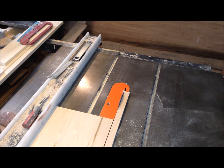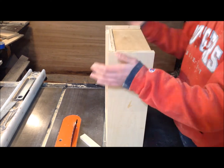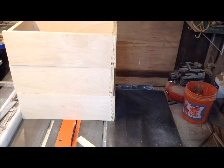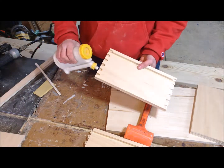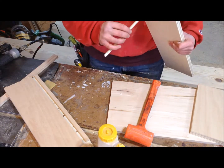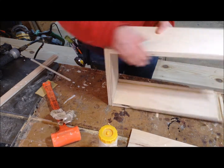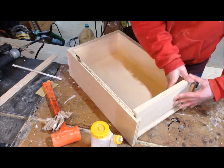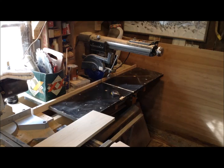Like most of my methods, I'll fully admit they are more time-consuming than other ways to build things, but I like them because they're structurally superior and very easy to assemble. If you cut all these pieces properly, these drawers go together and they're usually fairly square without having to tweak them too much. Once all that was done, it was just a matter of gluing all those dovetails — always remembering not to glue that bottom panel in place. Just slide it in, glue in the backer, sink a brad into each side to hold everything, check for square, and then sink some brads into that bottom board.